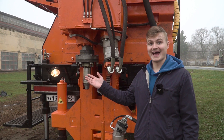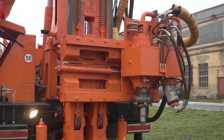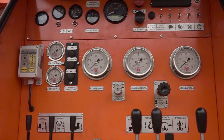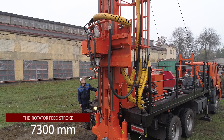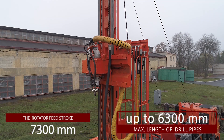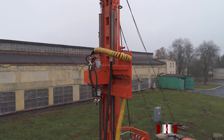The boring head is hydraulically driven with a through shaft with a hydraulic mechanism for draw-off at the well mouth. The draw-off mechanism is remotely controlled from a driller's console. The boring head feed stroke is 7,300 mm, which enables using drill rods with length up to 6,300 mm.